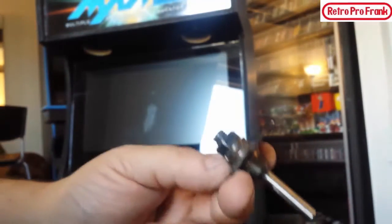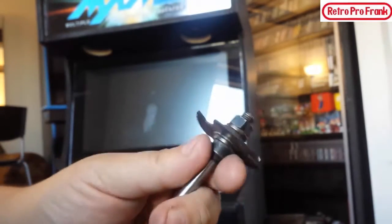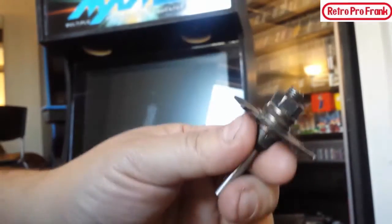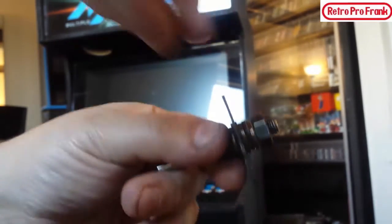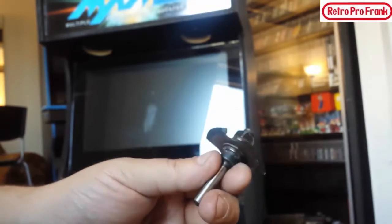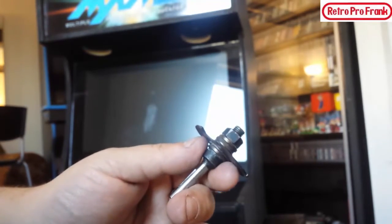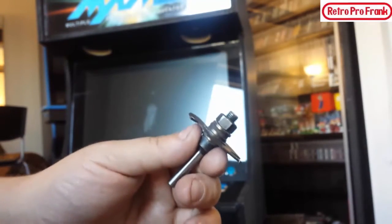1/8 is way too big, guys. It won't hold the T-molding. Here's the internet secret on this. Be ready, a lot of people are going to get pissed off that I'm giving out this information. You need a 1/16 slot cutter, 1/16 of an inch. It took me about a day to track this down when I built my first big one. Everyone always carries the 1/8. You need a 1/16 or else that T-molding will just fall out of position.